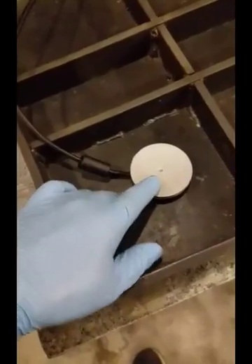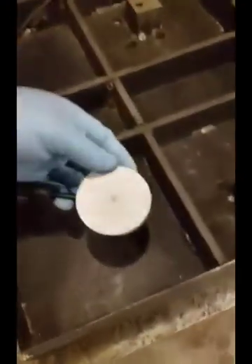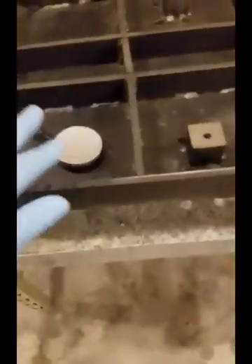The piezo transducer is very sensitive to sound, vibration, and pressure. I made this little hockey puck housing for it. You can buy these for about $30, or you can buy very expensive vibration sampling equipment, but I don't want to spend hundreds or thousands of dollars on something I'll use once. So I built this — it cost me about $5. It's filled with glass media so it wouldn't interfere with the electronics, and it's heavy, because if it weighs nothing it doesn't pick up vibration as well.